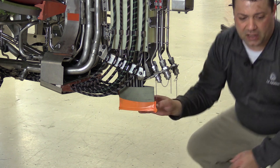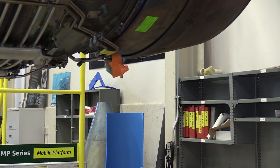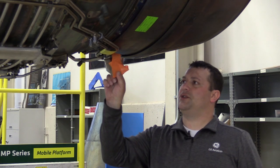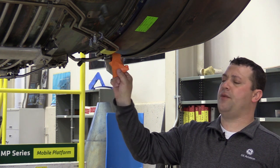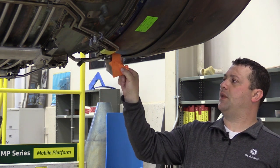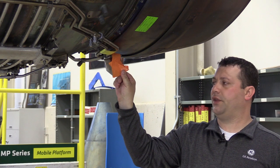Once that's done, you can move to the tail of the engine. Over here on the backside of the engine, by the TRF, you'll see your overboard cavity drain mast — we want to go ahead and tape that off as well. Make sure nothing gets up in there.